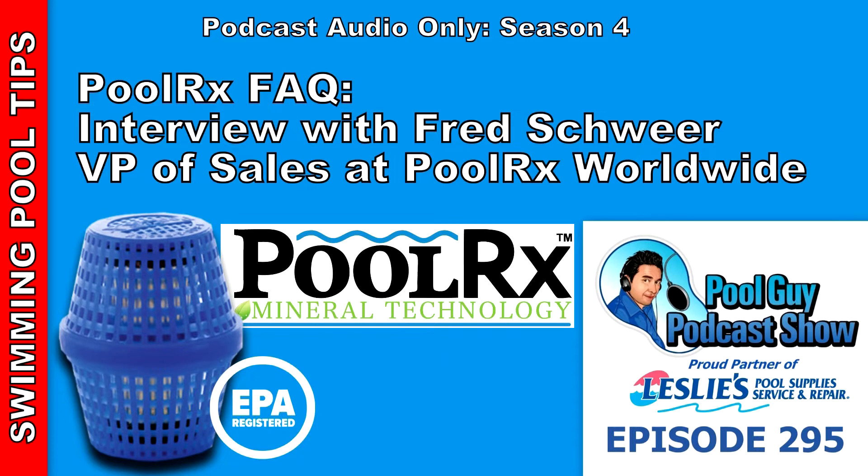There is an easy fix for that, but to avoid it, just make sure your pump has at least three or four hours of run time after you put it in. If it does happen and you see blue coloring on your surface, that's just undissolved granular mineral stuck to porous areas. A product we recommend is a phosphonic acid — Jack's Magic Blue Stuff — which will dissolve that mineral into solution. It's safe to use, you can still swim in the pool with it, and it works really well.